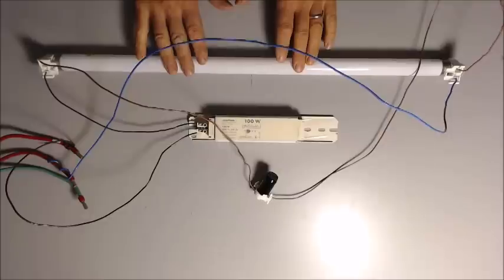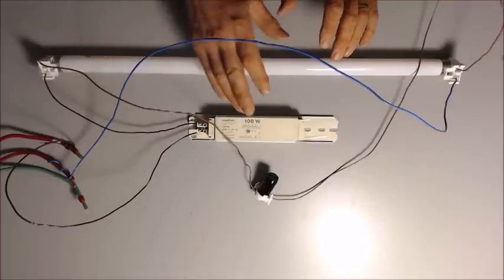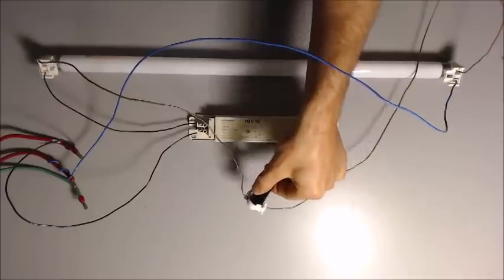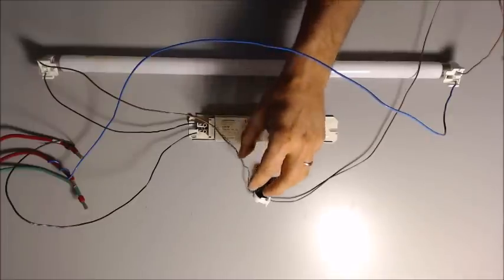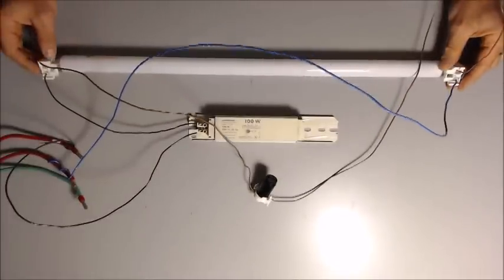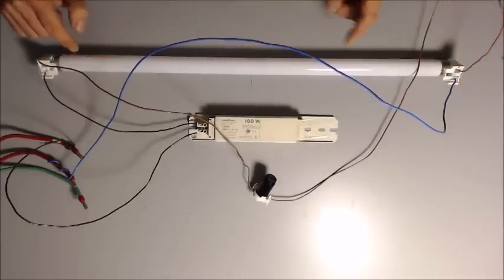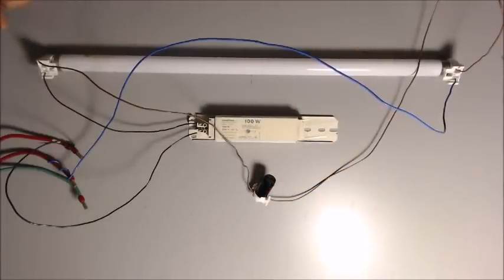Hopefully. If it doesn't, if the lamp is too cold, let's say that your salon is kind of cold, or it's in a basement, a light down there working as a light fixture, this circuitry will try and do it once again because it failed. Now this will cool down just enough that it will connect the bimetal switch again and start the whole process over again, creating a circuitry going through these cathodes, warming them up. That's what you can see when these are glowing red at the ends. That's the starter connecting the circuit through there.